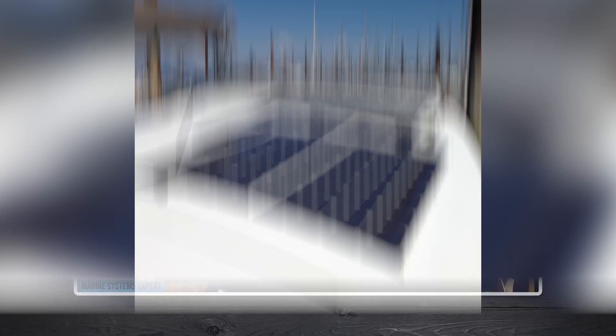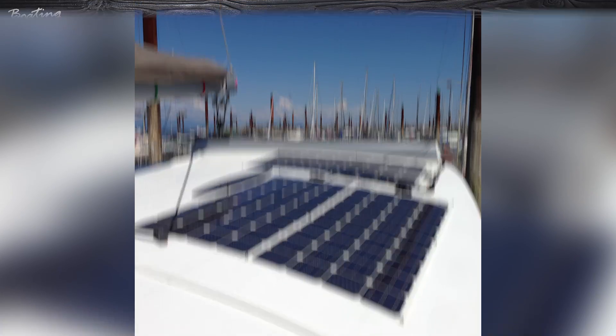In this instance, Paul says he has a 280-watt solar array. A 280-watt solar array, practically speaking, is probably going to give at max around 20 amps — and that would be a phenomenal output. It's most likely going to be between 10 and 15 amps. So Paul's 60-amp controller can handle a 280-watt solar array, no problem.